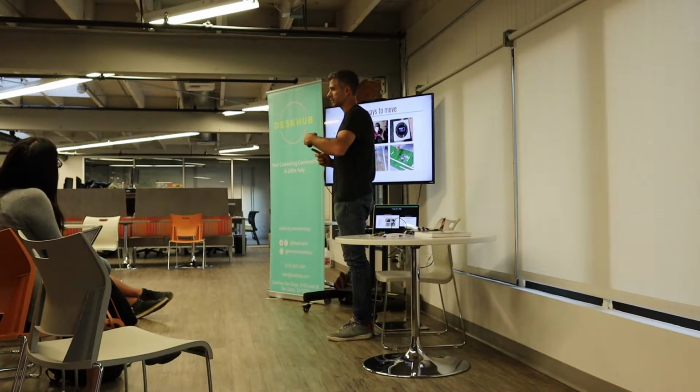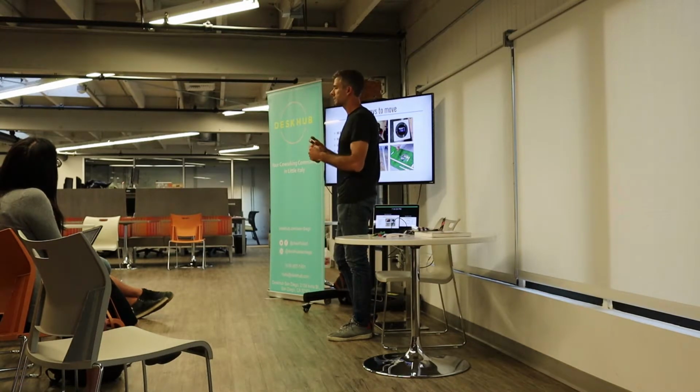So it's converting motion 90 degrees. But a nice thing about a worm gear and the way that the gears lock or intermesh is that it's self-locking. So if you try and push back on a worm gear, it doesn't back drive the motor. It has to do with the gear angle, which is why it's called a worm gear. But it's essentially just turning, I guess you could imagine like an egg beater that you spin the handle on.